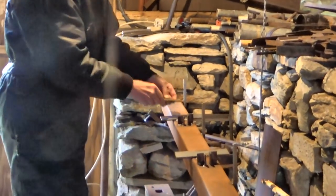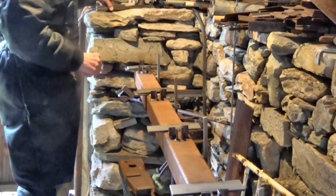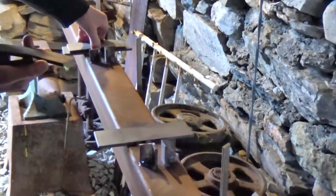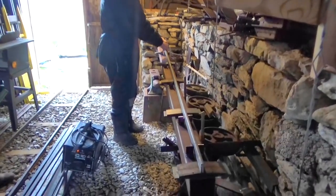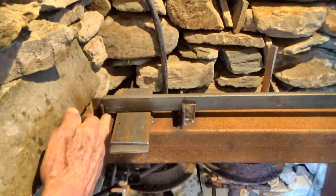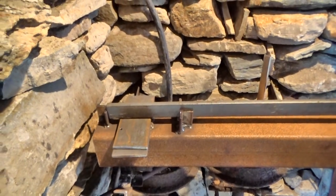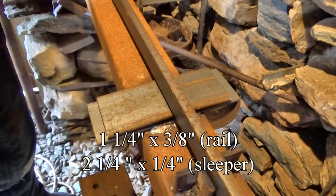These monorails are easy to make if you have a welder. But Clever Clogs Chris has come up with a simple jig to make things even quicker. I filmed him in his workshop back in the winter, but I was waiting for the finished railway so I could show you it at the same time. We line the sleeper up with the pad, and the stop there has it overhanging 7 eighths of an inch, which is about 22mm. That's 30x10 the rails and the sleepers are 60x6.